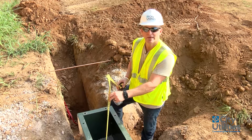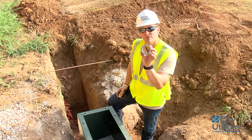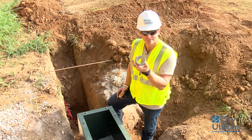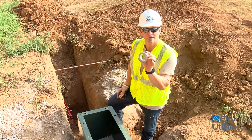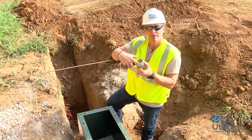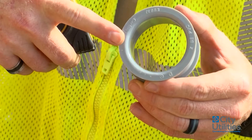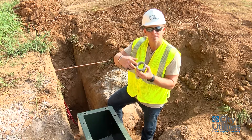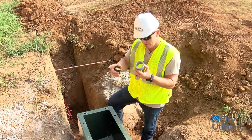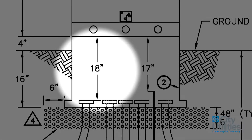So the finished product — he will have these FAs taken off and we're going to be installing these two-inch bell fittings. This is a two-inch bell fitting. They seem to be hard to find around Springfield. Every primary location that comes up out of the ground needs to have one of these installed as finished. The reason is this rounded edge right here — we pull in a plastic-coated or rubber-coated style of primary cable, and if there are any rough edges, even on the plastic, it cuts that coating away. So this is to protect the wire as it's going in. The contractor will take off the FA fittings, install this on top, and once he does that he'll have the proper 18 inches to the top of the sleeve.